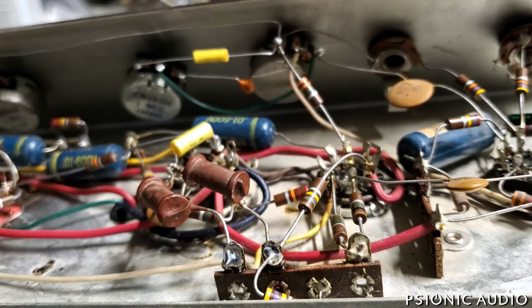A little less known is the 5F6A Bassman. The '58 through '60 Bassman schematic doesn't match at all in some very crucial ways what Fender was actually building and what left the Fender factory. Some of the very early ones would match the schematic, but that's not what left the door. If you build the schematic like Marshall did, you get something that sounds more like a JTM 45 versus what really sounds like a Tweed '58 to '60 Bassman.